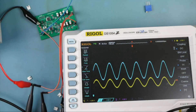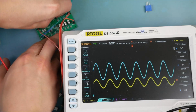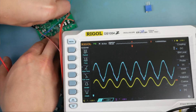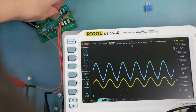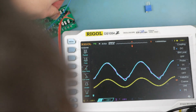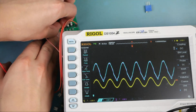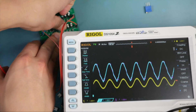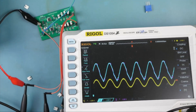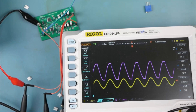Let's load these op amps. I'm going to start with a 0.1 microfarad load on the unbuffered op amp. And just as I did that, channel two starts to look a little funky. Channel two looks weird. What happens if we load the buffered one? Now let's take a look — we see a very similar distortion on channel two and channel three.